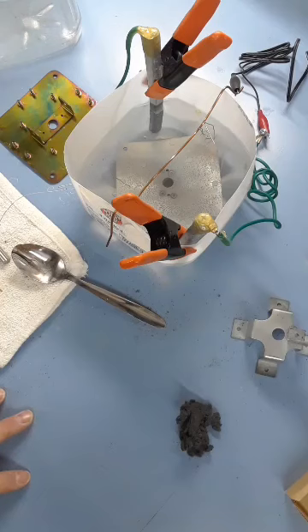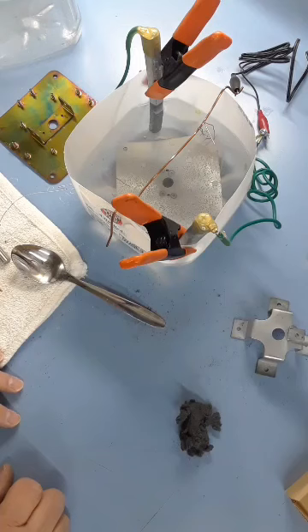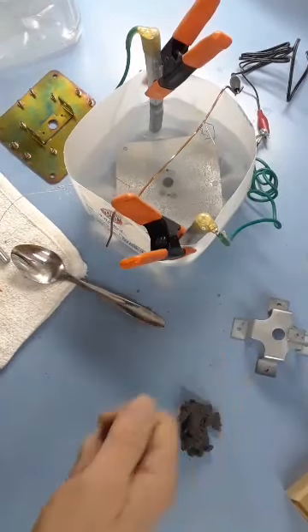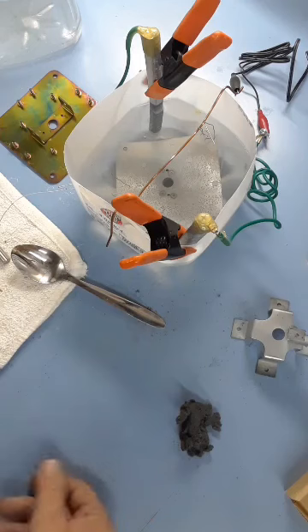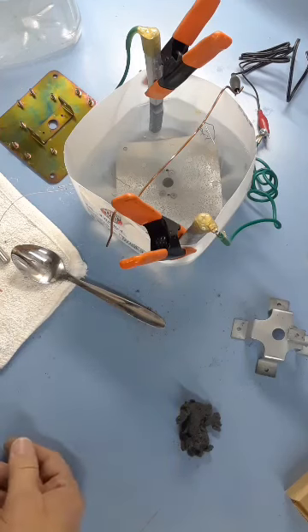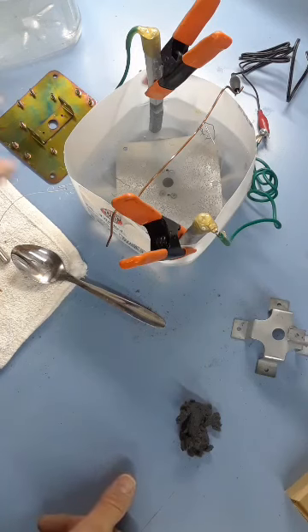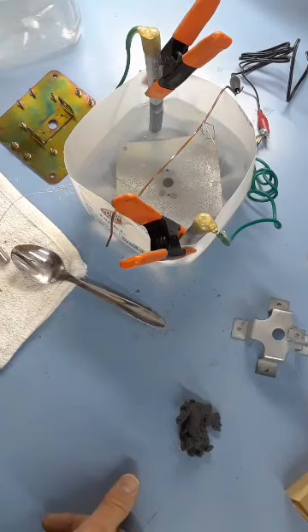I think you could plate the base of a Nintendo joystick with the bearing inside — no problem. The originals just rattle around in there, they're not super tight. So after you clean them out and degrease everything, you can shake them and hear it rattle. I think there's enough room. You could plate as long as you get it clean and degreased. I'm using 409 or Simple Green to degrease, then rinse with tap water, thoroughly dry it after sandblasting, and it seems to be working well.